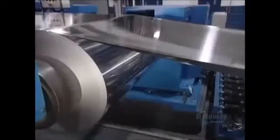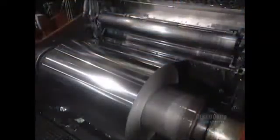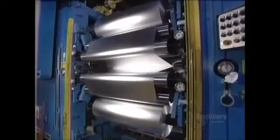The aluminum sheet has become very thin and risks being broken by the tension needed for cold rolling, so the sheet is doubled to avoid this breakage. One final reduction in the mill, and the sheet will have the thickness required by the customer. A liquid coolant is used to prevent the foil from sticking to the rollers. Since the edges of the foil sheet are lightly damaged and crinkled, a knife removes a 1 centimeter thin strip. Finally, the roll is cut to the desired width, and one huge ingot has produced foil measuring 12.7 kilometers in length.